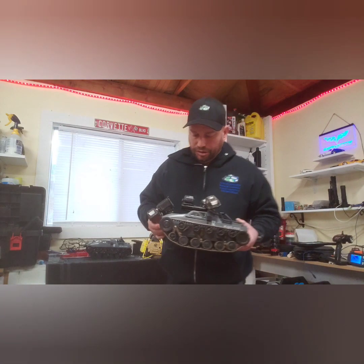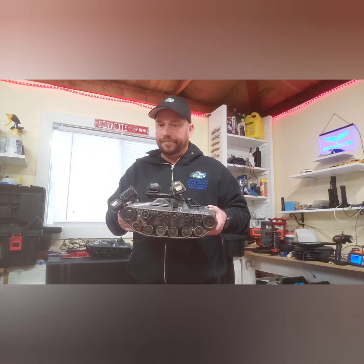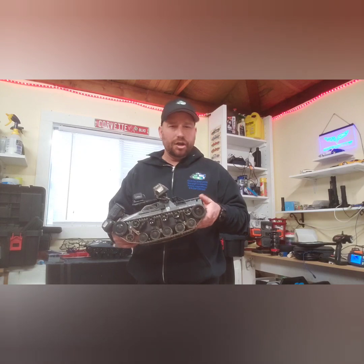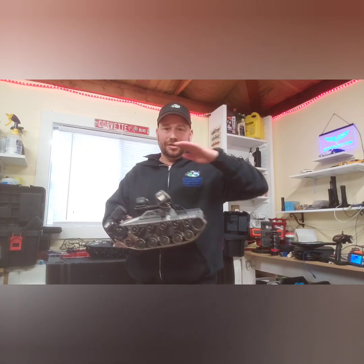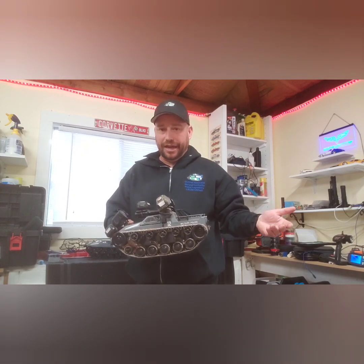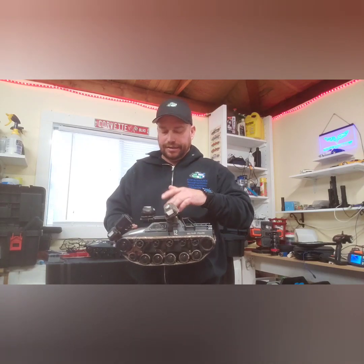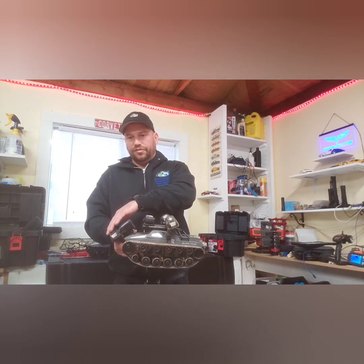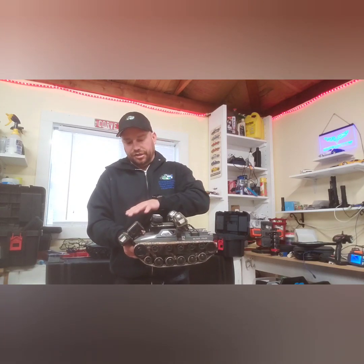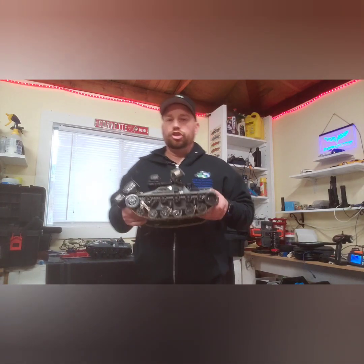A lot of these tools are standard, but some I actually made. This is a crawlspace drone that I built — I made about five of them a few years ago because I get situations where I can't fit underneath certain sections, especially if the clearance is less than 18 inches. I customized a drone and put cameras on it, along with a battery pack and lights. Each camera faces certain sections of the house like the perimeter foundation and girder members. I can take about 60 photos in two minutes underneath the house.